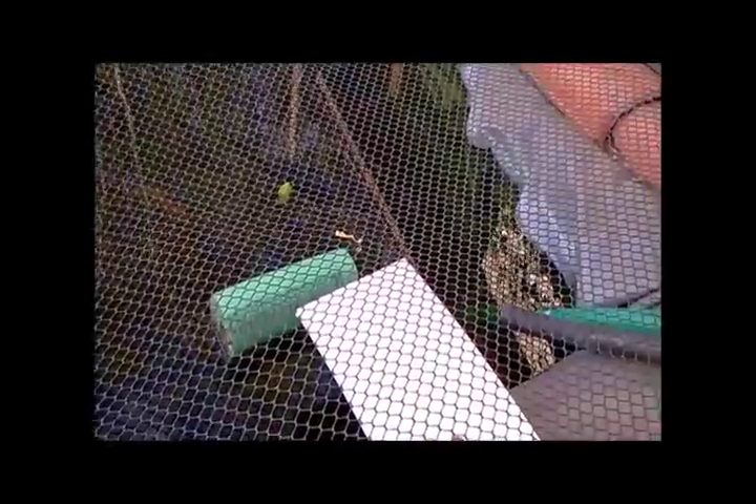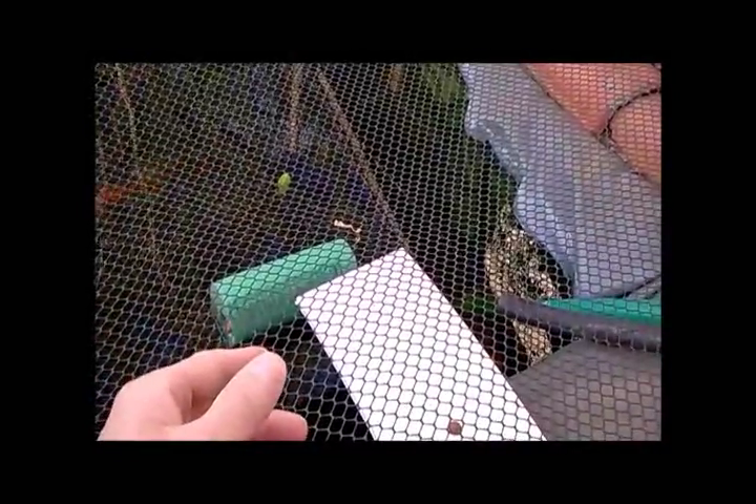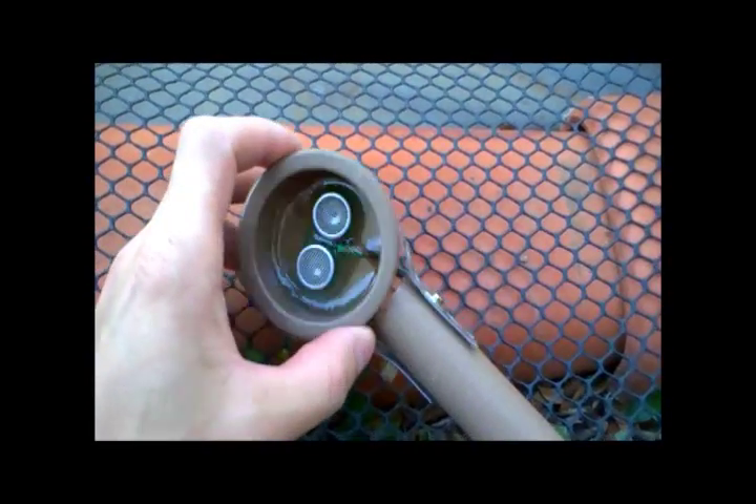But there's another way of doing that that is more complex, provides good quality results — at least that's what I've seen — and it's contactless, so it won't wear off with time. This method is the ultrasonic rangefinder, these cheap modules that you can get online. And I happen to have one, and now I'm going to give it a try. This is how I'm going to measure the water level with the ultrasonic sensor.